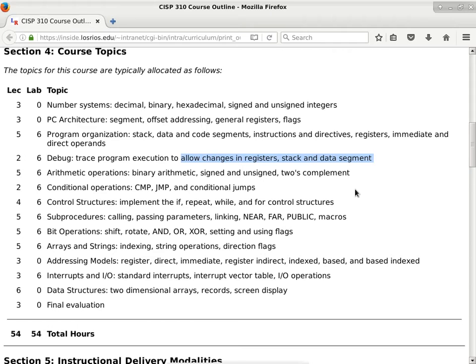There are two ways to do it. One is to have the data path feed into the second operand of the ALU. But when you do that, you will also need an additional mux, because now the input into the second operand of the ALU can be coming from a register or from the data bus directly. So you will need at least one more select bit out of the ROM. Now we'll need 27 bits instead of 26, to control that one little switch and say, do we want to specify the second input from data or from a register? So that's one way to do it.